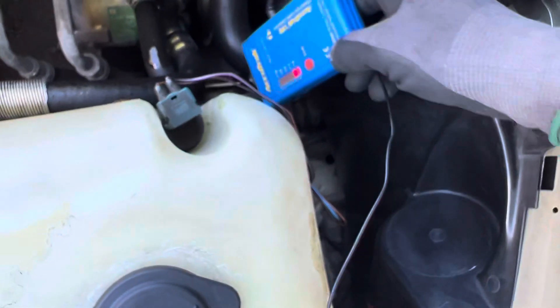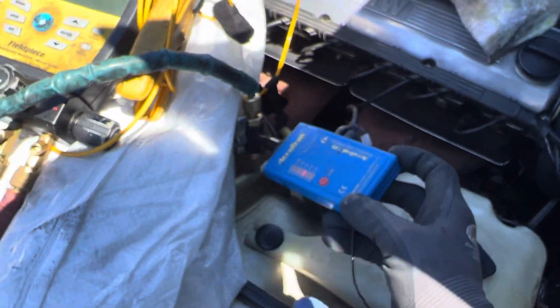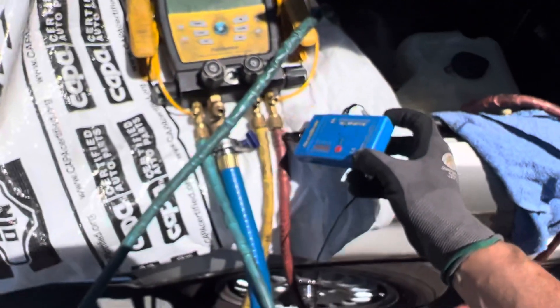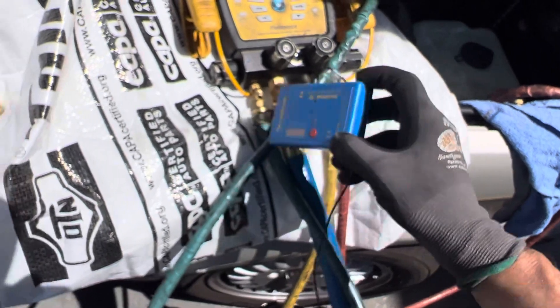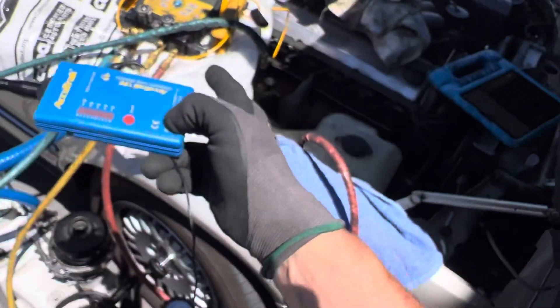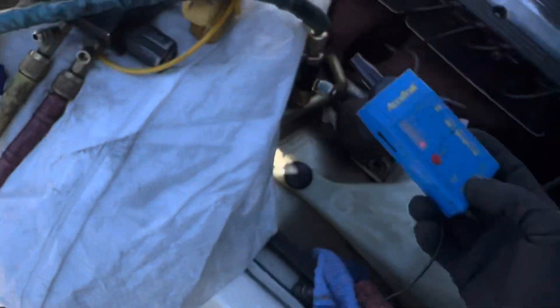You see that? Basically you'll go across — even go across your own gauges, go across all your fittings. Always double check. Every time you're doing one of these procedures, double check all your connections, double check all your hoses. You always want to know if your equipment is going to cause you trouble, so test it every time. That's all part of your daily routine.